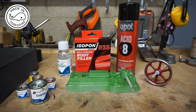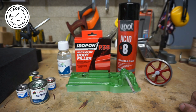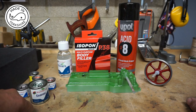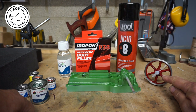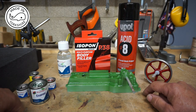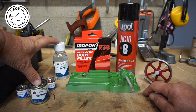In terms of colours, I've already started painting green for the top of the base and red for the flywheel. I'm using Humbrol enamel — the green is Brunswick Green and the red is called Crimson, number 20, both gloss. Around the edge I'll do that in black. For the flywheel I've painted that with a brush, while I'm spray painting the base. It's only partially done — it needs quite a few more coats — and I thinned out the enamel at a 50-50 mix with thinner.